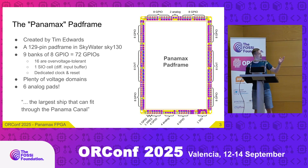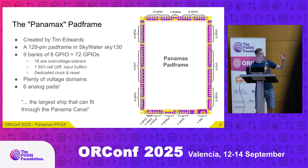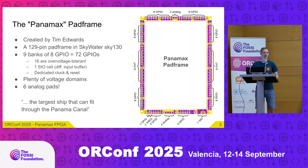There are also dedicated analog pads — four at the bottom and two at the top — so you don't have to share your digital GPIO with your analog pads anymore. The name Panamax comes from the largest ship that can fit through the Panama Canal, which is fitting because this is the same die area but the whole pad frame is just filled with IO cells.